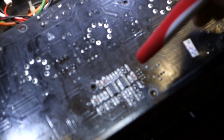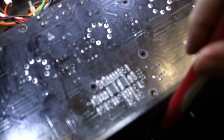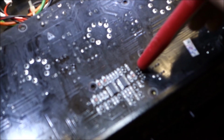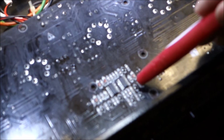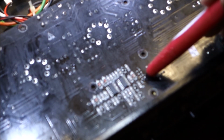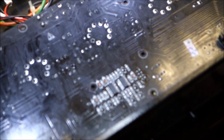The voltages that we're supposed to see, these top 2 pins, okay, so this is the front of the amp, the volume knob's up here. This is where the reverb module connects. We should have about plus 15 volts, about minus 15 volts. These next two pins do nothing. This one on this side on the bottom row is the in, and this one on this end is the out that goes to the reverb pot and out.